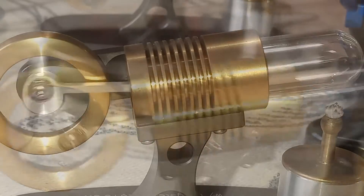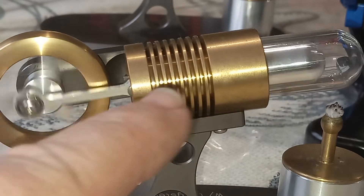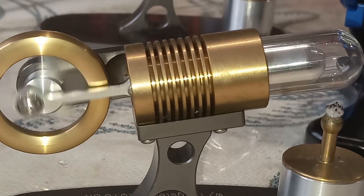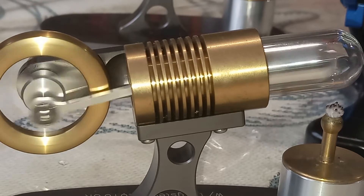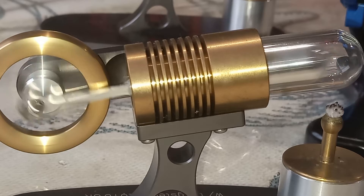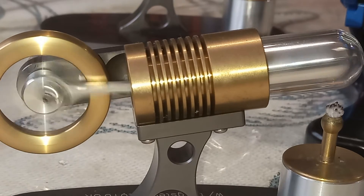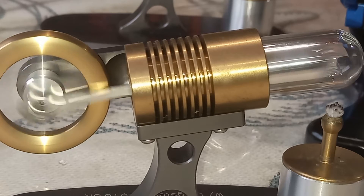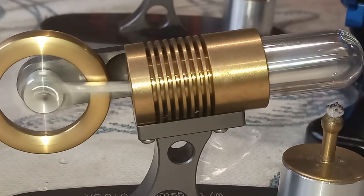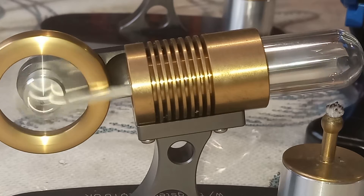Another weird thing about this engine: it will quite happily go in either direction. It has just three moving parts — displacer piston assembly, conrod, and flywheel — and it works equally well either way. It doesn't care which way it runs. So far this engine is silent. Not such a challenge when you only have three moving parts, but once it speeds up you hear it humming. It's possibly not the most interesting engine to watch, but it is interesting to try and figure out the Manson cycle. If you hush down everything else in the room, you can hear this valve chuffing away in the engine, but it's a very quiet thing to hear.